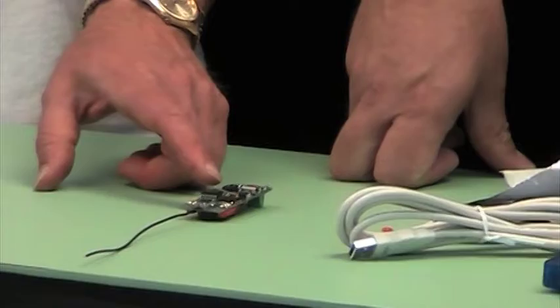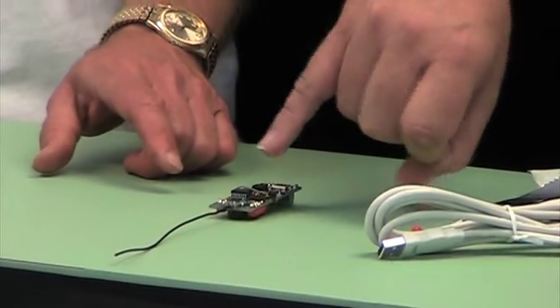You mentioned there's a pressure sensor and an accelerometer — so why do we have a pressure sensor, an accelerometer, and GPS all on one board? GPS is really wonderful for knowing the latitude and longitude of the rocket, but GPS is somewhat challenged for determining altitude. It does very well if you aren't moving really fast in elevation, but rockets tend to go really fast when they launch. Having the barometric pressure sensor allows us to get a more precise indication of the altitude the rocket is actually at in any given moment, and gives us a faster way to detect when the rocket reaches apogee.